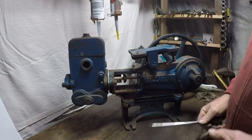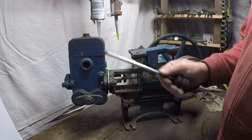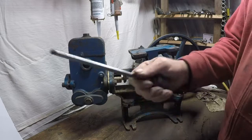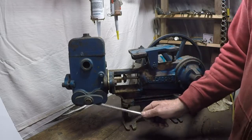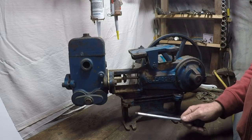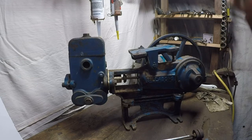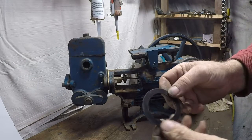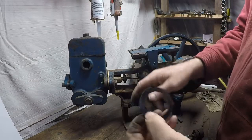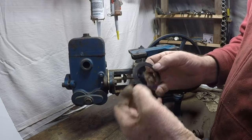And then another thing that would cause it, and this is also very common, is somebody's kinked the hose, or because the pump's pushing such high pressure that these two bottom valves will blow out. Now once they blow out, I'm just going to find one here for you. It'll blow out the side, and that's perfectly fine. It's not the end of the world.